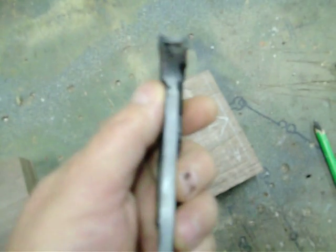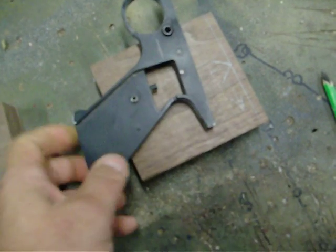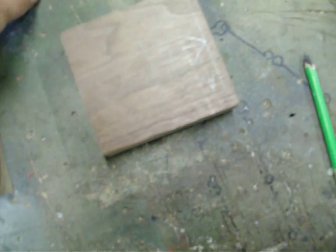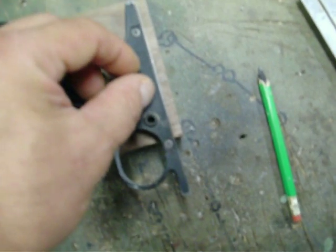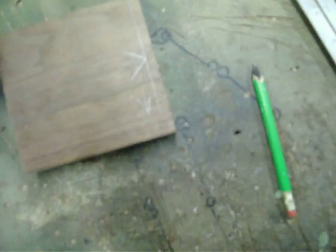You can see the grip frame has a step in it here and a step in it there. All I do is I just go straight up and make a 90 degree. I'm transferring these marks very accurately here and here. I'm taking my square, and then I remove all of that material and I leave some material proud that will sock this in. Then I can sock the grip down with a screw through this big block, put it in a vise, squeeze it, and it will leave these two marks from these two pins in the wood.